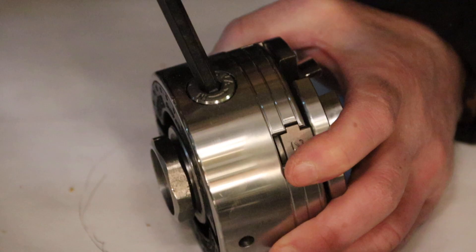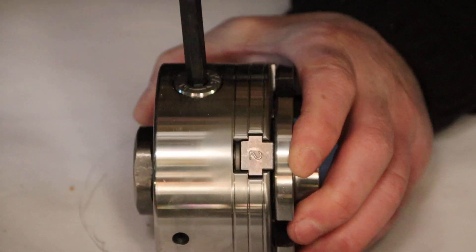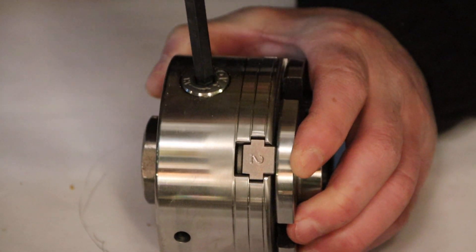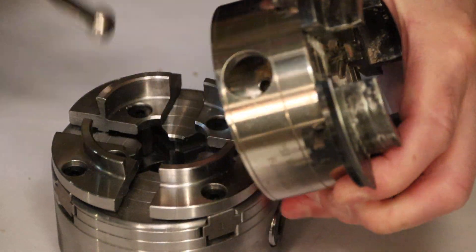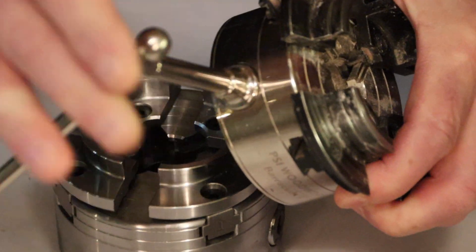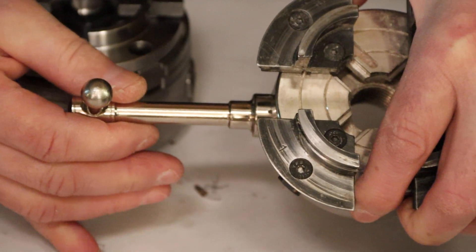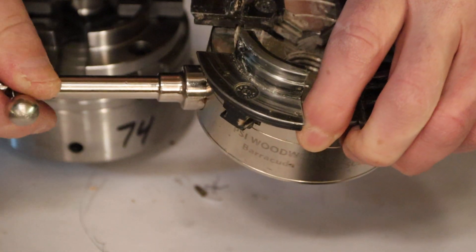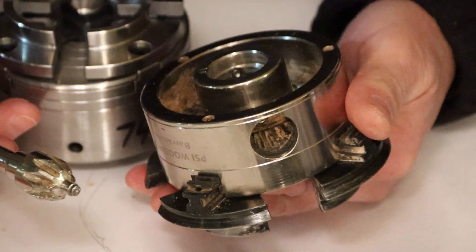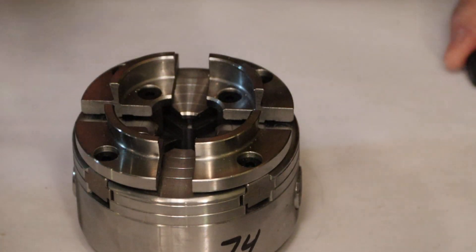You can misalign it at an angle if you need to work around a workpiece — if there's a workpiece right here, it tilts. And you always get good contact as long as this is in here. As with the Barracuda, because of the shape of the T-handle, if you don't have good contact and you're not pushing in and putting pressure in this way, this will actually start to back out and you'll start to disengage. It's a finicky, fiddly thing — you have to be sure that you have pressure in here. It's a nuance that doesn't stop you from getting it tight. Just something you get used to.